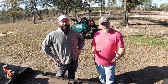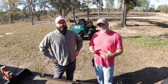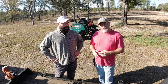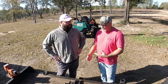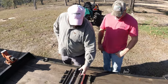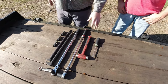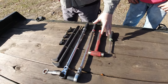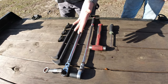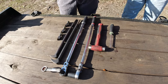When you're changing the cutting teeth on your Woodland Mills Stump Grinder, there are certain tools that you'll need and some that you may have to fabricate. So Brandl, what did you bring? We've got a screwdriver and a hammer. Because the stump grinder is going to be in wood all the time, some of the pockets are going to be stopped up with wood, so we'll use that to knock those out. We've also got a long ratchet with a 15/16 socket — you can use 15/16 or a 24 millimeter, they're super interchangeable.